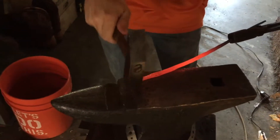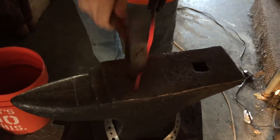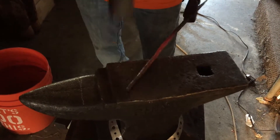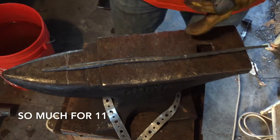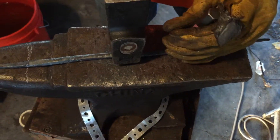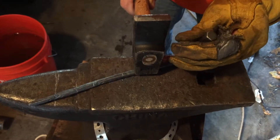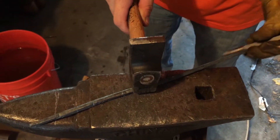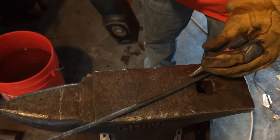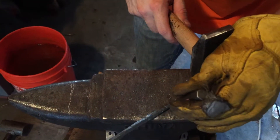Grinding's an important part of this aspect of our work. You see that ball-peen hammer we made? That thing was ground to perfection. I put a mark in about five inches in from each side — Matt didn't know how to taper so we're a little long. We're going to put a rivet in here, maybe. I just have to put little marks in it so I know where to start my twist while it's hot, because those white chalk lines wear off in the heat.